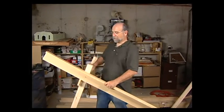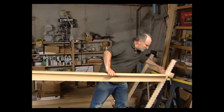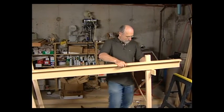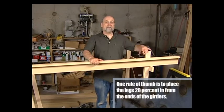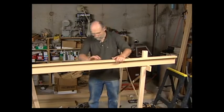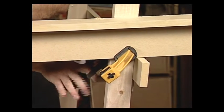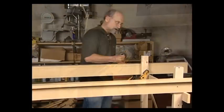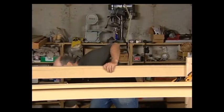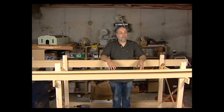I can angle the legs out to about 90 degrees — that makes it easier as I pick up and put on the other set of legs. How far apart you put the legs is to some extent purely a matter of convenience, though if you're building a larger layout and you know you need them in particular positions, that can affect your choice. The last part of L-girder benchwork is to add some diagonal braces from the legs up — we'll show how to do it right now.